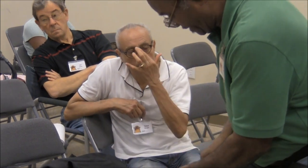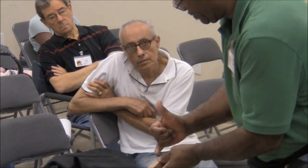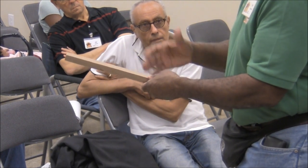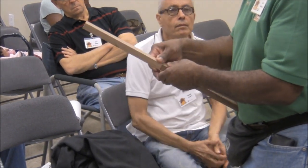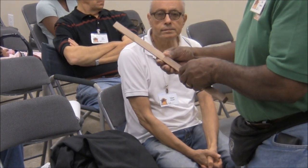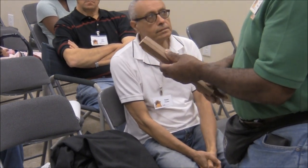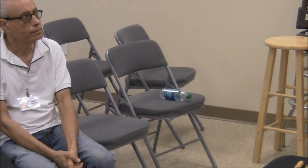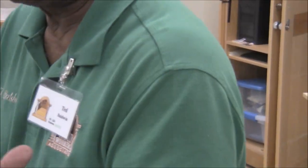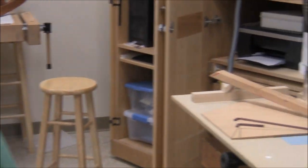The glue needs to go into the fibers on one piece of wood and into the fibers of the other piece of wood, and that's really what holds. And if it's glued properly, the glue joint will always be stronger than most of the wood you're going to use. So if the glue joint comes loose, it means something we didn't do right. Okay? Now, we're going to turn one. Are you ready, Jimmy? All right. What I've done...